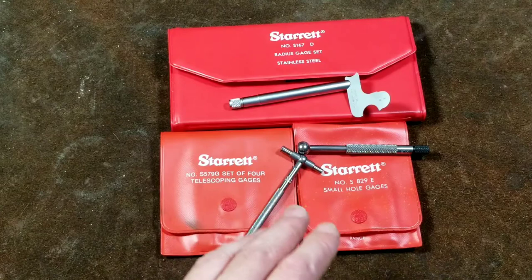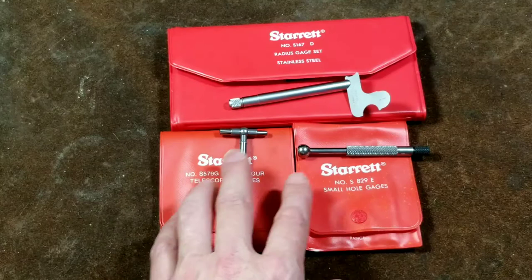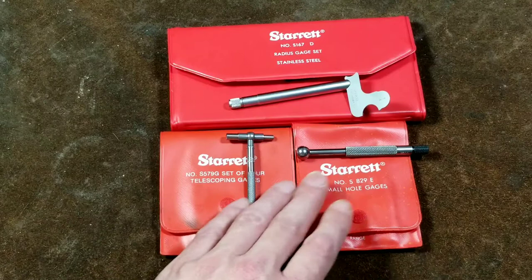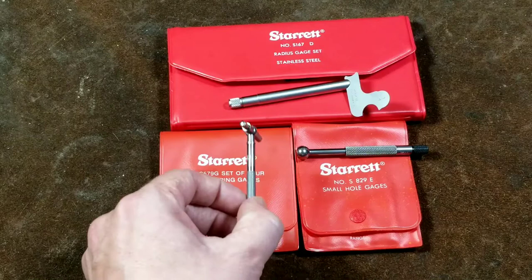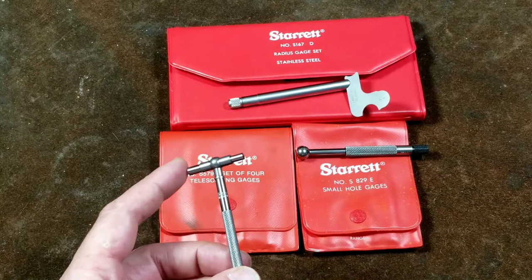Since these are my three Starrett gauge sets, I just decided to include them all in the same review for the sake of having a little bit less redundancy. These are going to be the most common type of gauges I would recommend somebody have if they're going to get into not just machining, but automotive work too — you need these to measure things from guide pins and alignment pins to brake calipers, anytime you really need to get an accurate measure inside a hole. You can't really rely on dial calipers, especially if you need to go deeper or need multiple measurements, and because the tops of bores or cylinders often have some kind of lip you need to get past.